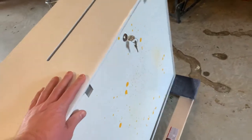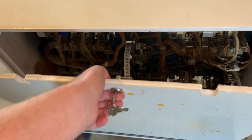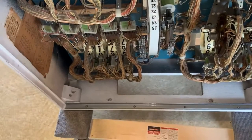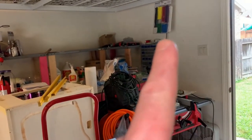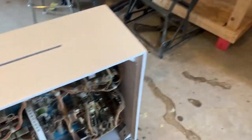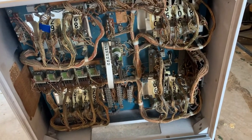I don't know why I keep saying 'we' — it's me, I did it. We made this back door. I keep getting questions on how to replace the door. If they're gone, you can sometimes find a metal one but not very often. You can get an aluminum U-channel — it comes in like eight-foot lengths; I got that at Lowe's for a couple bucks. You just cut it to length, stick it in here, the wood fits in it and it locks into place. Not rocket science, pretty simple.